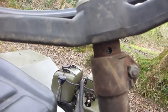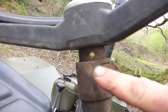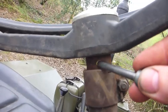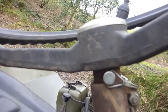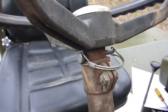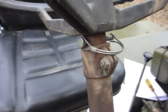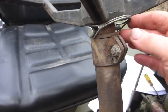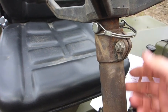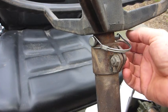So I've fitted this little device here — turn the wheel and you see that little spot of daylight appearing there. I insert that pin, which locks the steering, which means I can easily move the machine around using the arm. This is a real boon. I've machined this component but I'm sure there are simpler ways of doing it, and it really makes a massive difference when you're using the digger.